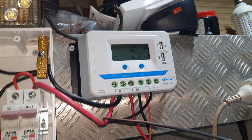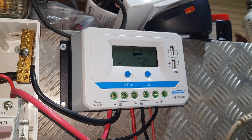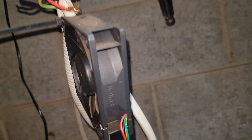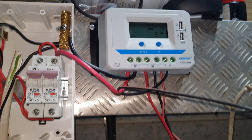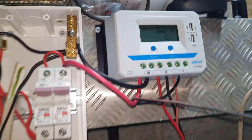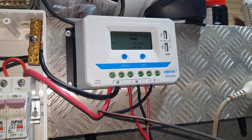It sometimes runs the fan as well. The fan just blows a bit of airflow through here when this is charging hard at 30-odd amps. It only pulls about 0.3 of an amp when charging hard. It has an aluminium backplane so not only does it have its heatsink fins, it can also dissipate heat into the aluminium.